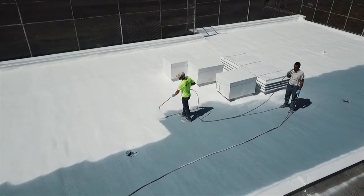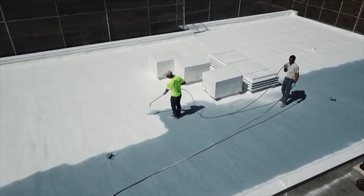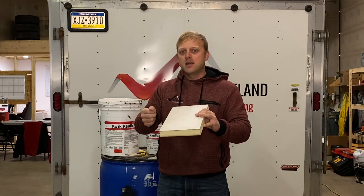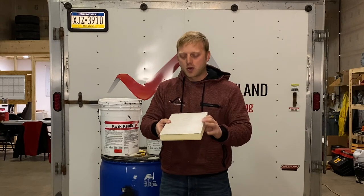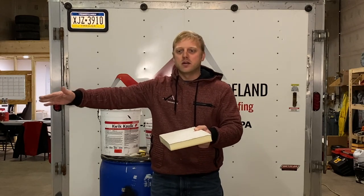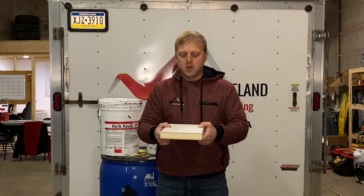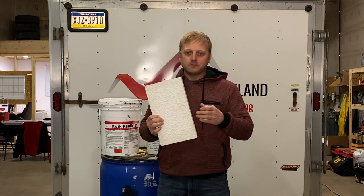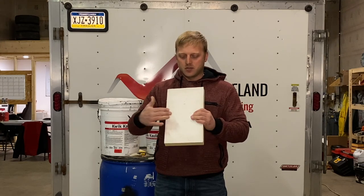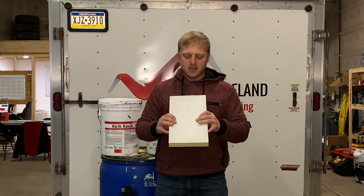You want to see just a little bit of it bubbling up — that feel to it. Make sure you get a consistent pass, or you'll come back and have little blue streaks coming through the white top coat. Very consistent coverage on everything — make sure you don't miss any area or leave a strip between two passes. Spraying takes practice; not too thick, not too thin. That's the final step, and it's the most fun — afterward you've got a nice white roof.